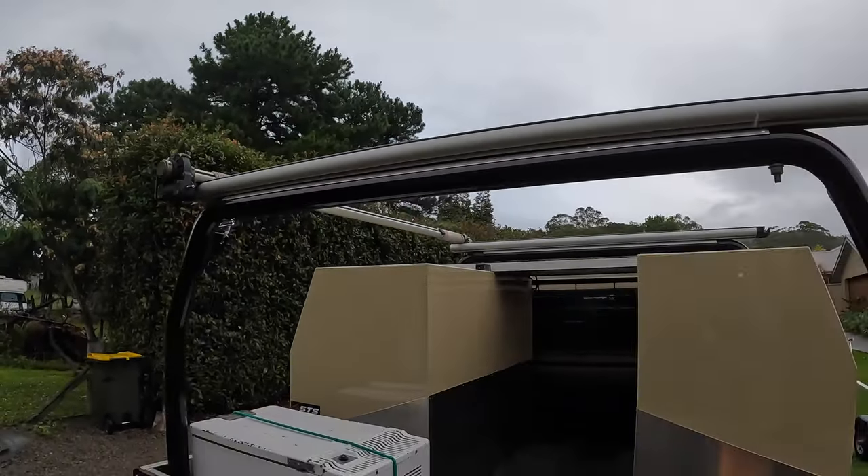So we used AliCleaner and then we really polished it. We got the boat off the trailer because we're going to use a product called AliBright. I haven't used this particular product before but I have used AliCleaner. You don't want to get this stuff on anything that's been anodised or anything that's stainless steel, because it will eat the coating off - it's just a diluted acid wash really. So that's what I'm using, and if it comes up really good, you'll know how to use it.